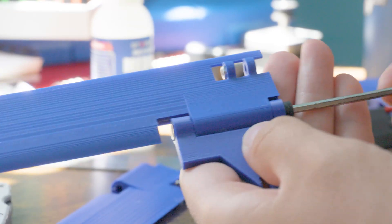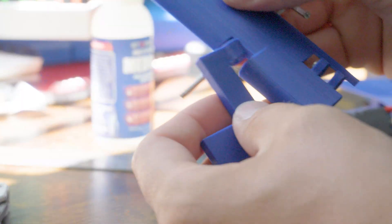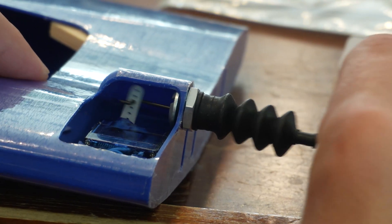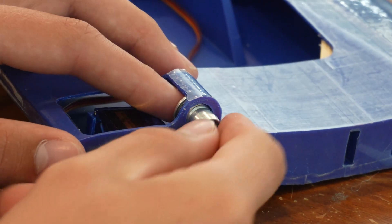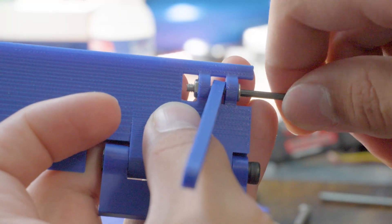Moving away from that idea, I started assembling the steering components. The rudders are printed lying flat, split in two pieces, and later glued together for rigidity along their standing axis. One of them is controlled using a pushrod setup from a servo which is mounted inside of the boat. I bought little rubber boots on Amazon to flex with the control rod's motion and hopefully keep water out. The other rudder is turned using a linkage that bridges between the two rudders, attached with M3 bolts.